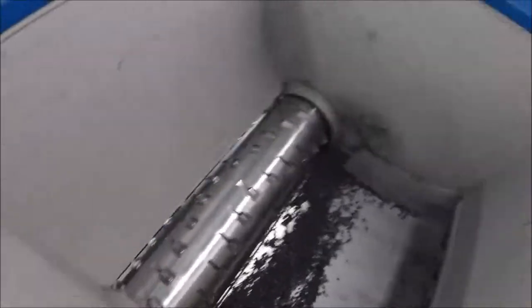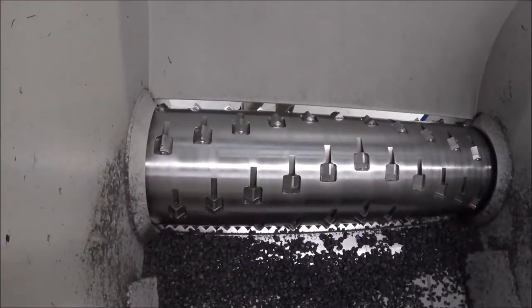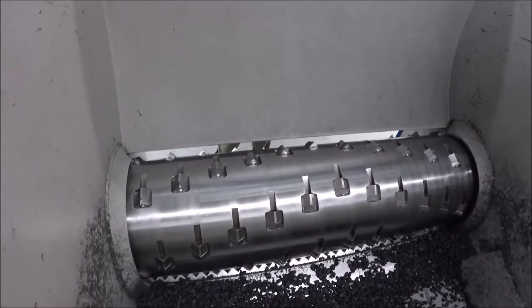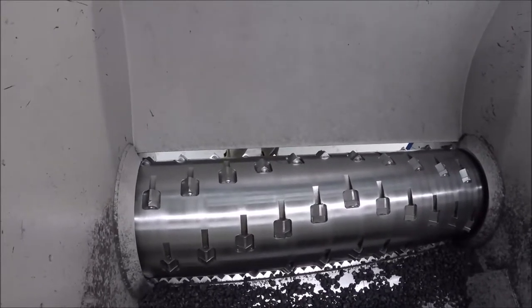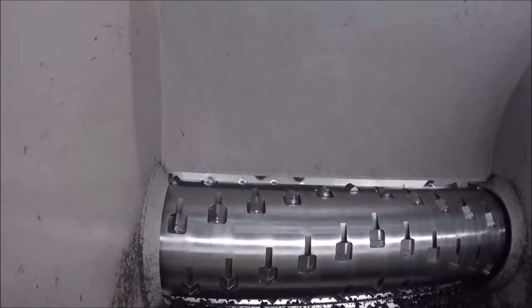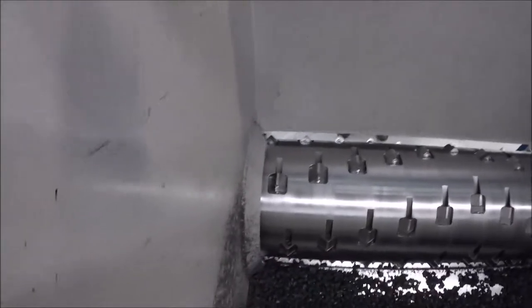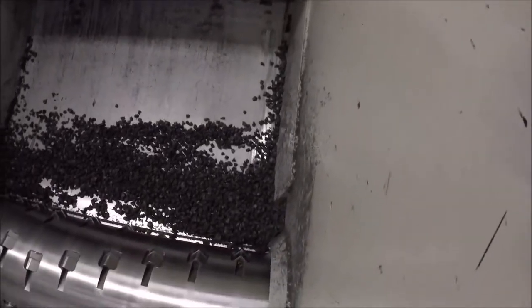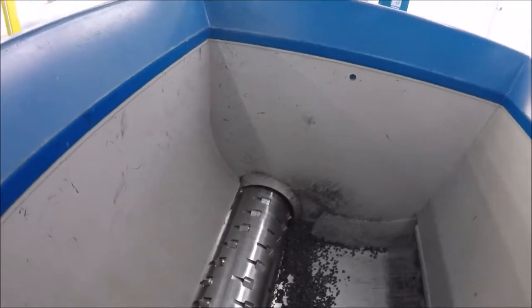What we normally do is somebody will get into the machine and do this clean-out procedure. They'll also — if you see right there — those knives in the front of the rotor have a knife plate. We basically unscrew those plates, rotate the knives, and clean out any material that may hang up in that area. While one person is doing the knives in the front, a second person is cleaning out the internal area, pushing the material down, then vacuuming out all your hang-ups inside the shredder. Your main hang-up area is going to be in those corners of your rotor — just vacuum it out.